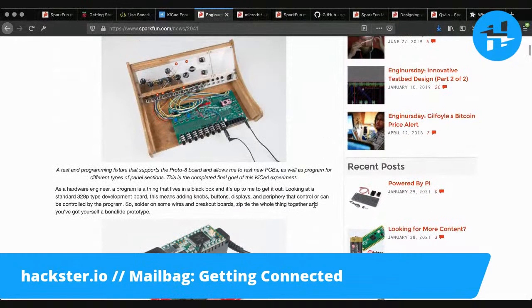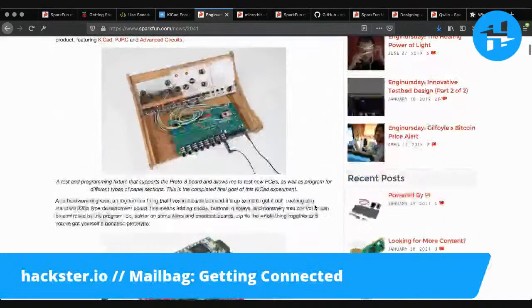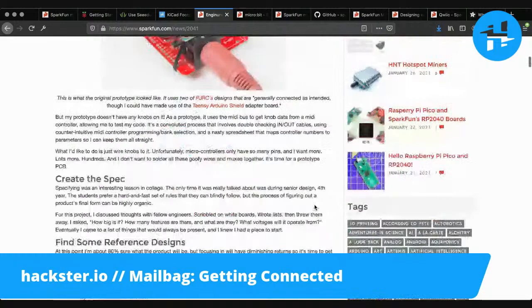The Teensy is one of those middle-of-the-road ones where, like the Raspberry Pi, the ESP8266, and the ATtiny85, all of those have your standardized breadboard-friendly, PCB-friendly 2.54mm header pitch. Most Teensy boards have the same pitch as well — I've come across a few boards that look like it but don't quite have the same pitch, but Teensy generally does. So you could make your own little footprint and drop it in if you wanted, or use the resources available and linked here.